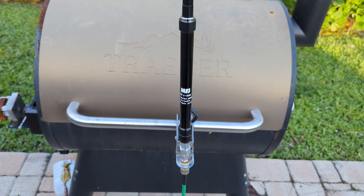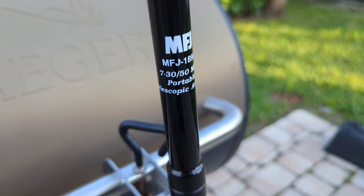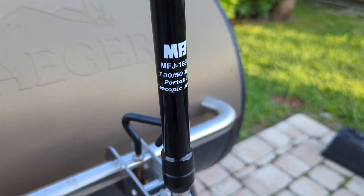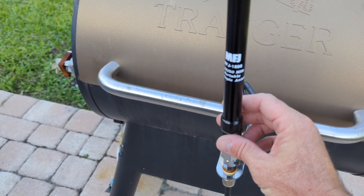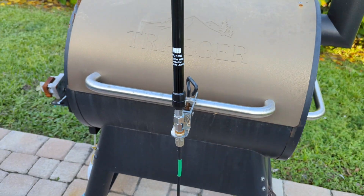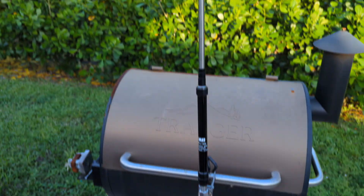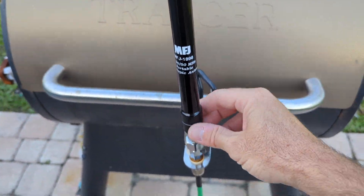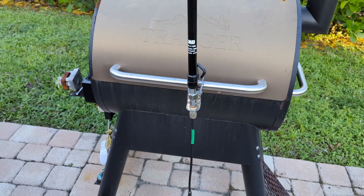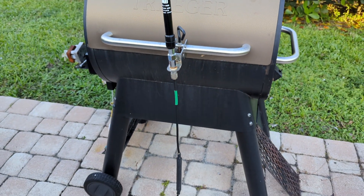Anyway, this wouldn't be your exceptional choice for a contest antenna — I never got to use this thing. It does 6 meters up to 40, so 40 through 10. And 6 meters — all you do is loosen this and slide it up and down, and you'll see a little bar graph here. It's a cool portable antenna clipped on with a Chameleon jaw mount, with a little whip on top. You loosen it, go up and down, listen for maximum signal, then tweak for best SWR. A ground wire or counterpoise would do pretty good off of this.